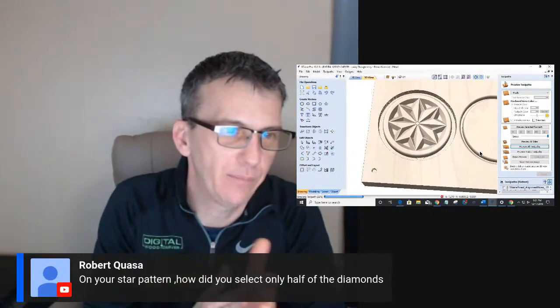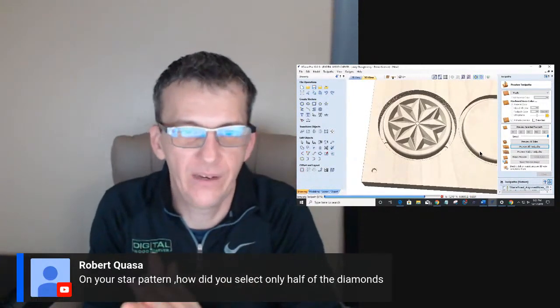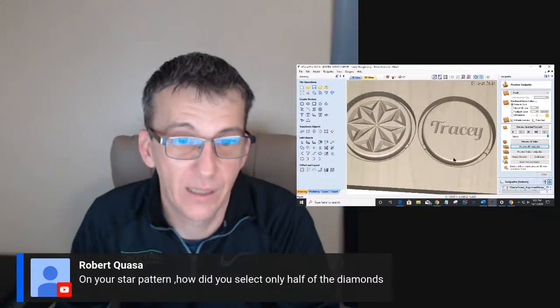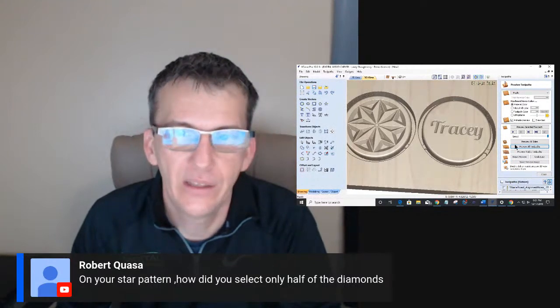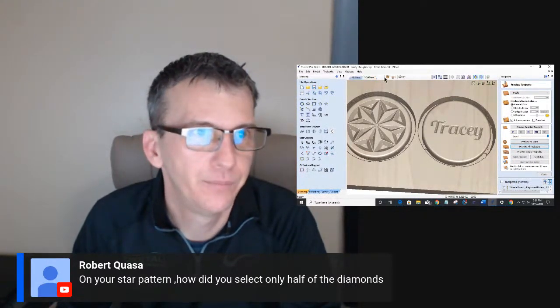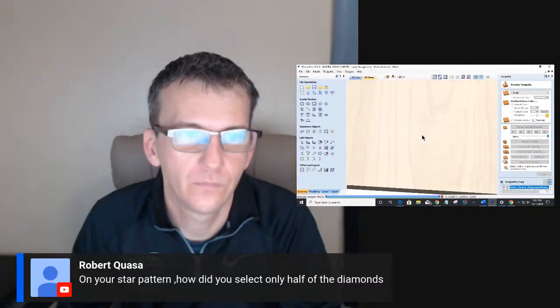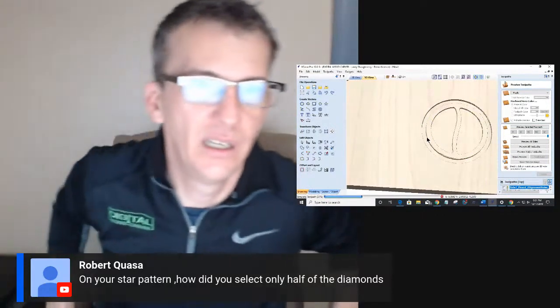I'm going to go ahead and cut that profile out. Cut that profile out to 5/8 of an inch deep. Carve a little V-carve in there. That V-carve would be done before the profile cutter. It could be done after because we're only cutting halfway through. And then, of course, on the other side, we got our little inside pockets, cutting an inch deep.